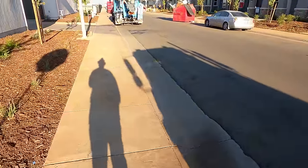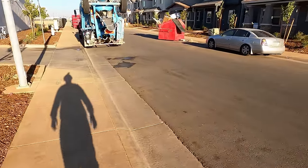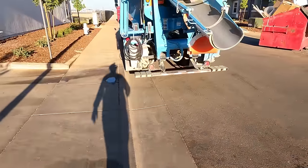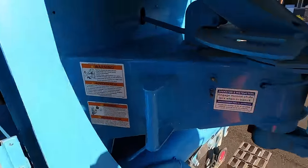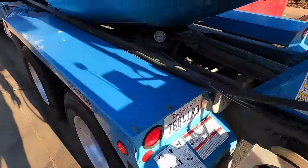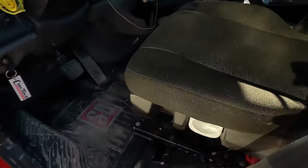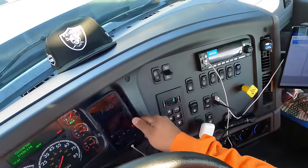Now it's our turn. We're doing one truck for 3-inch. And now we're gonna go back there with the 4.5, 5. They like it pretty wet though, so I wouldn't be surprised if they asked me to put it up to about a 5, 5.5. Get our chute set up. They see we're at about a 4.5, maybe. You don't know till you see it.